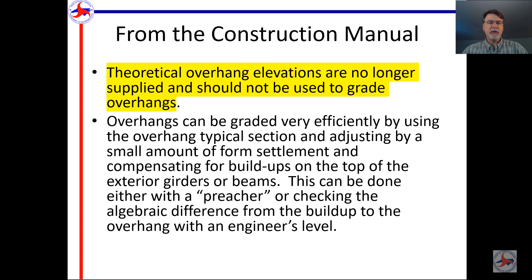This means we used to have calculated elevations for the overhangs in the construction elevations, but we don't use that anymore. The reason is that if you go out and set your overhang grades in the morning and then come back in the heat of the day and check them again, the temperature change can affect the camber — especially in that steel girder — and you could end up with errors. We revised the construction elevations a couple of years ago, so all new ones coming out should not include that information. In a few minutes we'll look at what information is included, which makes your job much easier.